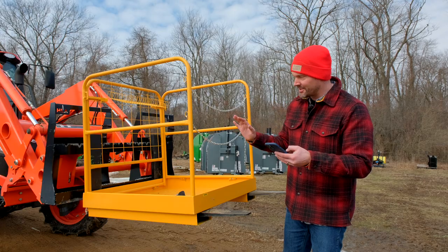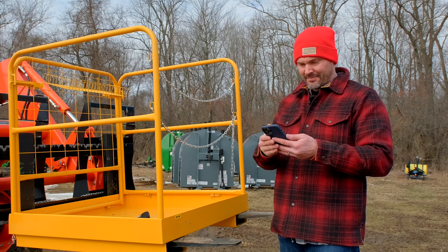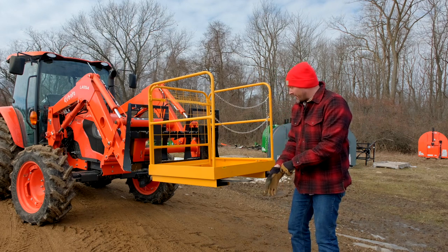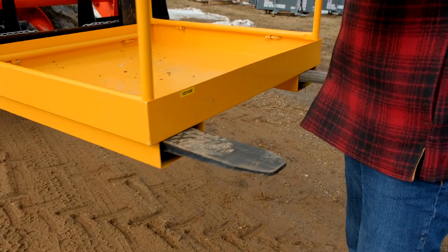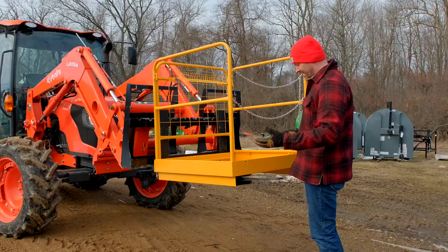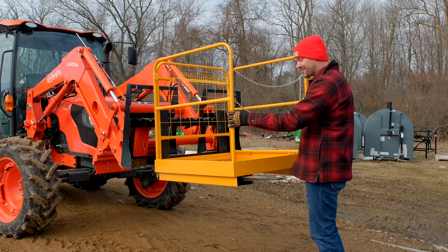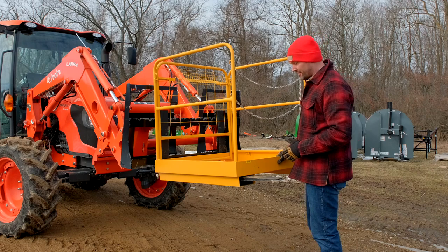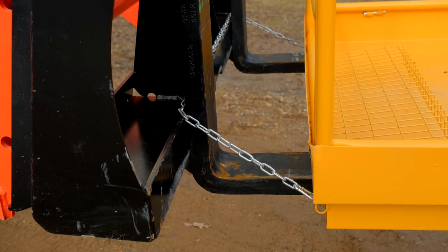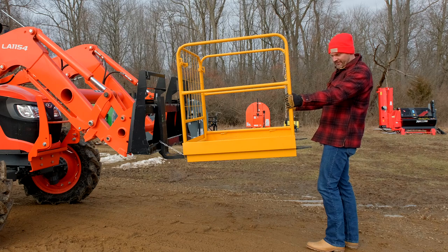Let's go through the features and details of this thing. I'll give you my visual walk around. I mean, you can bend this metal right here, just really easy. I'll let you know what I think — you've got to make up your own mind if it's worth it or not. The first thing I don't like is right there: these are oversized fork slots, which make it easier to get this onto your forks. But for compact tractors and a lot of smaller construction equipment, they're not going to have forks that are that wide. So you have a lot of slot, a lot of play. It's an unsettling feeling. There is a chain back there which would help prevent it from coming off the forks, so as long as you have 48-inch forks or longer, you should be okay.